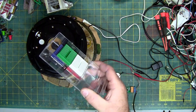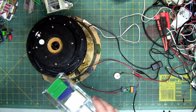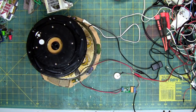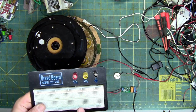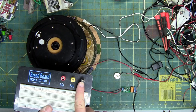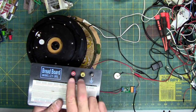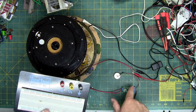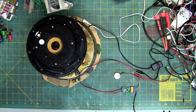Here's more of those breadboards — you can see blue, red, white, green. I have several and they come with double-back tape. The reason I might do this in two parts is I might use a larger breadboard to build the lighting circuit and test it, since I can plug my power directly into it, then go ahead and integrate it in here. Also, if you notice, this larger board has a negative and a voltage A and a voltage B, meaning when something takes two power sources, I can run two power sources to feed my circuit for testing.